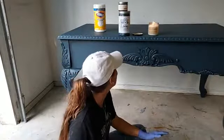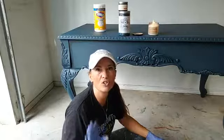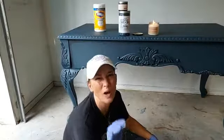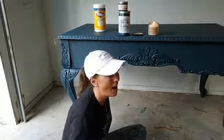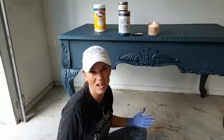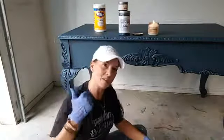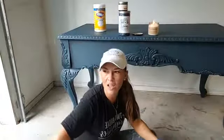I don't get brush strokes with this. A lot of chalk paints are so matte, there's no sheen, and you're supposed to wax a lot of them. I never waxed the chalk paint I used when I started six years ago — I polyed it. I don't want to wax and I don't want to tell my clients that in six to twelve months they should re-wax it, especially if it's a piece that gets a lot of use. I did not top coat the gel wax. I've never top coated a piece I've done in All-in-One paint, ever.